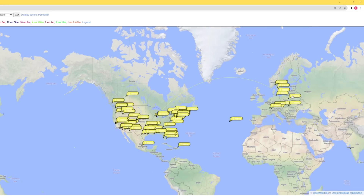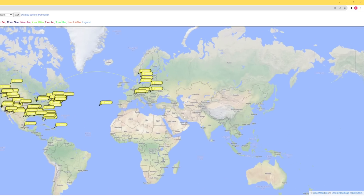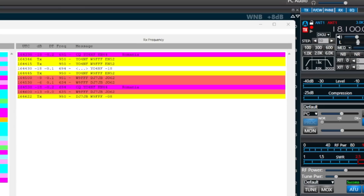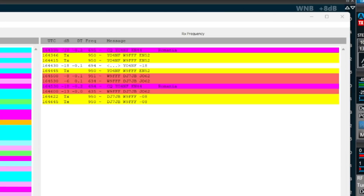The SWR just went through the roof after just five transmissions at 70 watts on 17 meters. In just those few calls we were being heard across Europe, slightly in the US, and in Mexico too. The core overheated quickly. Back down to 40 watts now — hoping to reach a Germany station that was hearing us at -8, -6, and -13, but we were a bit late for that response.